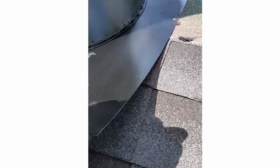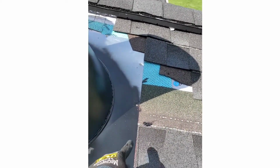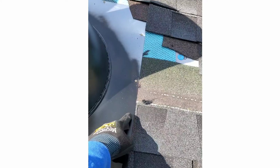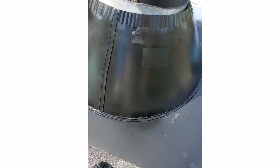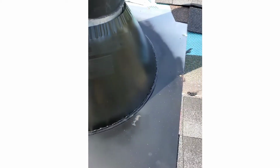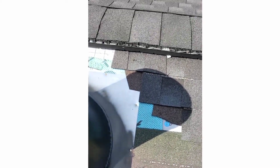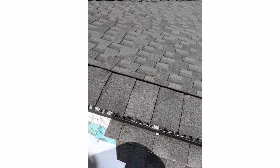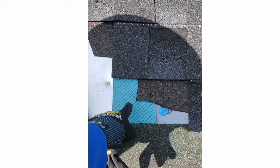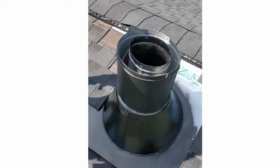So these shingles go underneath, and we went ahead and just put some cement underneath there for fun, but you know, water entry point is getting underneath this flange here. If it travels sideways at that angle, there's still nothing underneath there. And so that's what we want. We just nailed the top every 6 inches or so. And this piece of ice and water actually comes out on top of this shingle, just as an extra precaution.